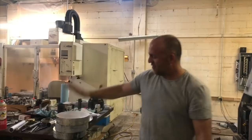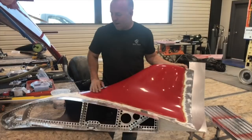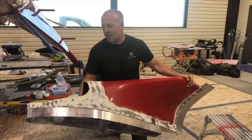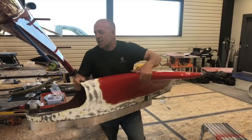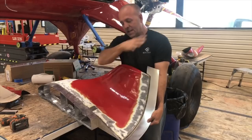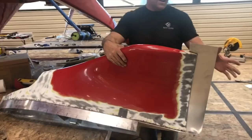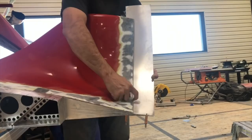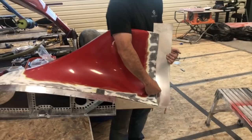What I've got here is the remnant of the wingtip that I already have. The back, the front, was a completely different shape. I've cut a few pieces and extended the front of the wingtip. The back of the wingtip is not long enough — I've got to come out three more inches to match up with the extended ailerons. So I'm basically stretching the front and the back. I've put on a simple piece of aluminum as a guide. I'll lay up carbon on this side, build it up — take the metal off, go to the back side, micro it, layer it. I'll taper that back to the new length at just about three-sixteenths of an inch in all carbon.